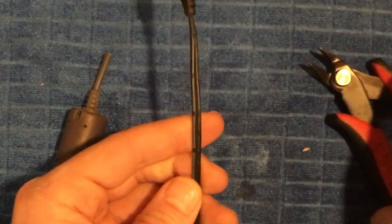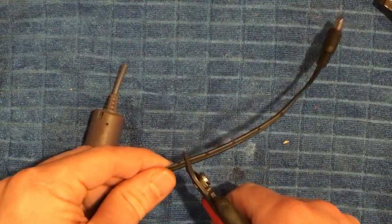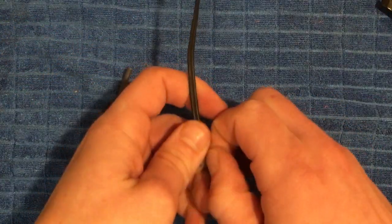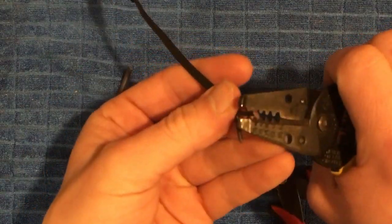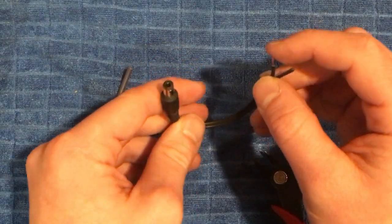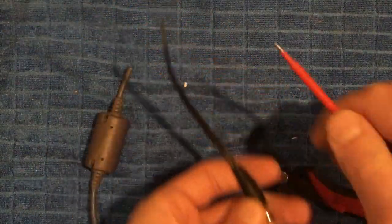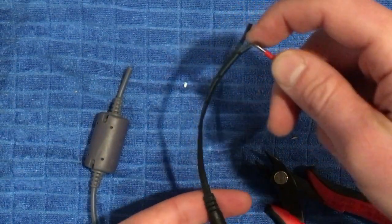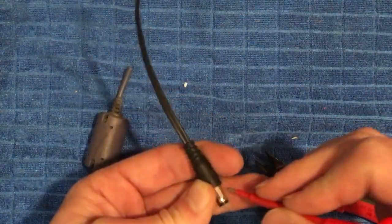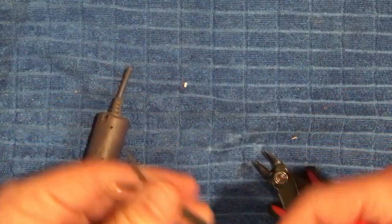We want to match that up with the tip on this adapter. So I'll grab my tip, leave myself about five or six inches of extra space, and cut it. I'll cut it down the center as well and strip some of the sheathing off. Now grabbing my multimeter — I hold one contact on the sleeve on the outside, one contact on this wire, and that gives me nothing. If I hold it against this other wire I should get a beep — and there it is. So that means the outside is on this wire that I haven't yet stripped. We just have to keep that in mind on how we're going to connect these together.